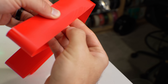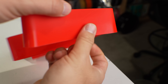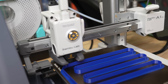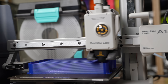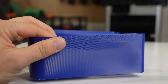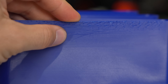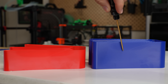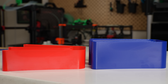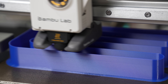I didn't notice any hidden surface quality issues until 21 cubic millimeters per second, at which point extrusion became much more inconsistent with some curling. Surprised by those results, I increased the range for the high-flow PETG to run from 8 to 40. The high-flow filament is already more matte than basic PETG, making the initial transition harder to identify, but the surface is much more uniform. We can still see when the transition to inconsistent extrusion and curling occurs — and placing it side by side, it's much higher up. Extrusion stayed consistent up through 28 cubic millimeters per second, giving us an approximately 33% increase in flow rate — a much more sizable bump than I've previously seen.